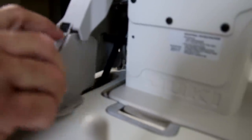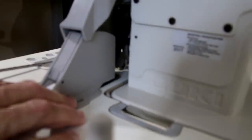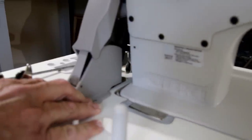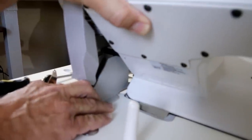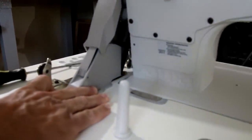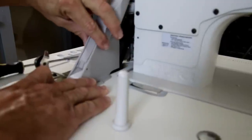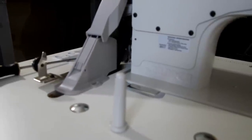This stanchion for our guard — we need to watch it when we're putting in the back guard because it's got to ride over top of this curve. So we've got to make sure we mount that in properly. It goes in like that, and we've got to have it placed in the right place so when we tilt it back, that guard is going to ride over top. If it doesn't ride over top, you don't have it in the right place. So I'm going to mark approximately where we need it — basically all the way back right there — mark my holes, drill it, and put it in place.